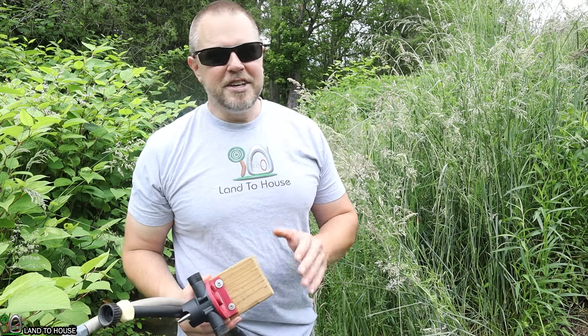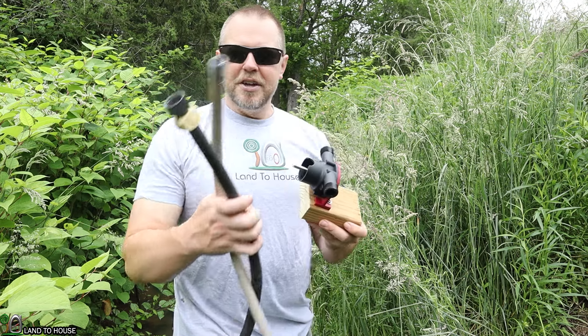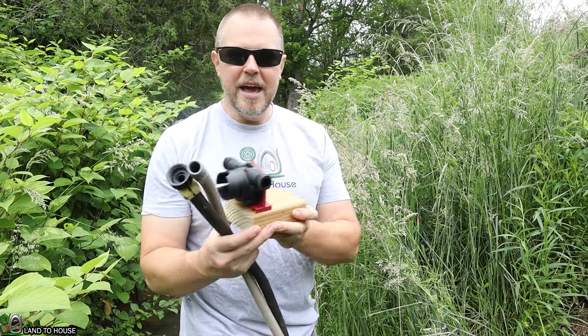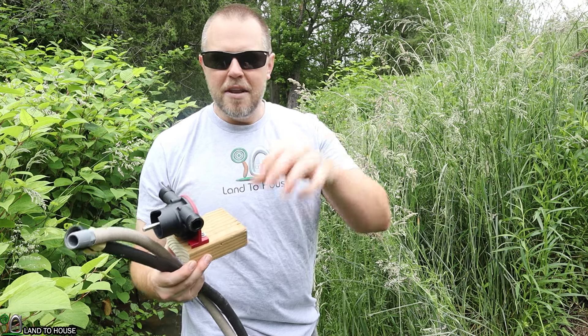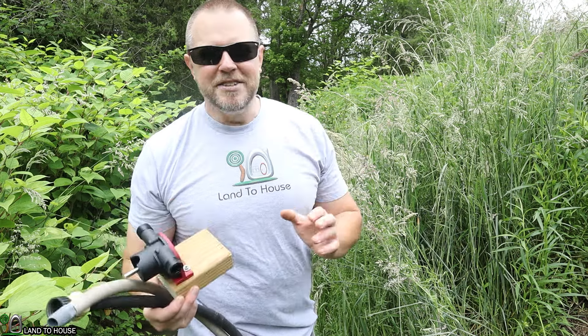Fast forward about two weeks — I spent 45 minutes trying to get the drive pipe full of water and never managed to get it full. So I purchased a drill pump. This is going to use two pieces of garden hose and a drill to get water out of the creek and fill up that drive pipe. It should make this process way easier.